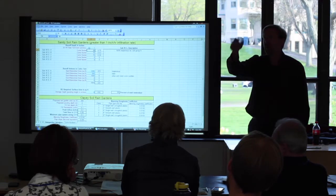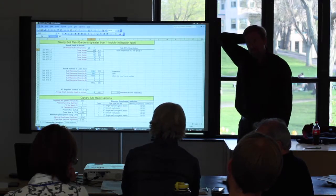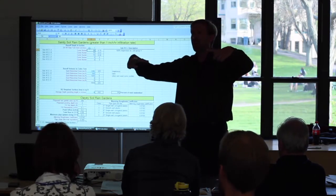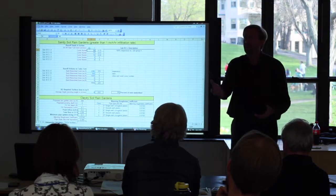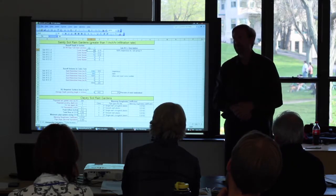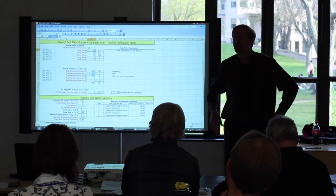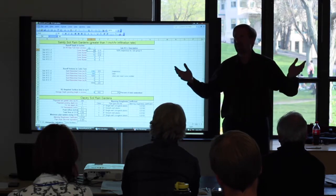Okay. You said, in looking at the pervious areas, gardens in there? No, no. Oh, yeah, pervious areas. It's easier to calculate a large area than a whole bunch of little ones. So the gardens usually will soak in more water at that site, but just consider it lawn. It's just easier. Anything pervious, go one way. Anything impervious, the other. Otherwise, you're trying to calculate smaller and smaller bits, and as I said earlier, keep it simple.